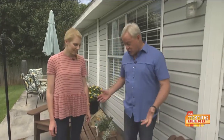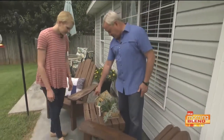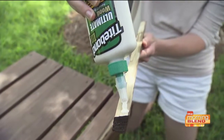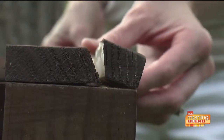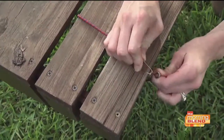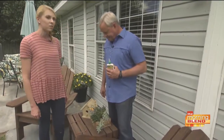So what happens if we're doing some of this cleaning and we find a couple of things that need to be repaired? Well, a lot of times you will, on the deck or on your fence or gate. Actually, we were getting ready yesterday and Chelsea found a little situation here. The board on the end of the table had cracked. Instead of replacing it with a new board, which wouldn't have matched the existing ones, I repaired it with some wood glue — just a simple line of glue down the crack, then cinched it together with small bungees. Now that the glue has dried, you can't even notice there was ever a crack there.